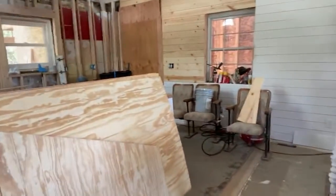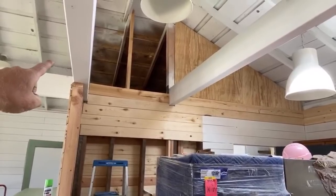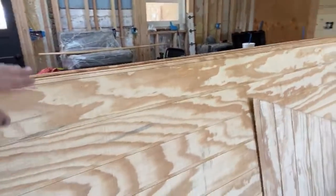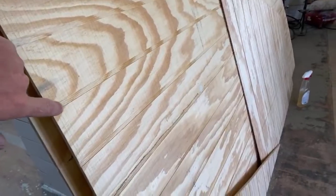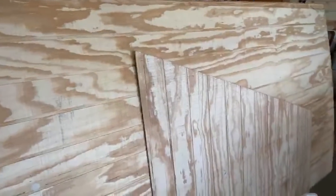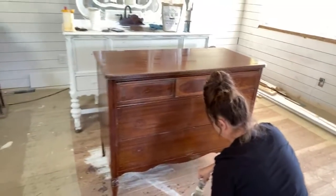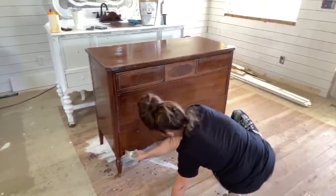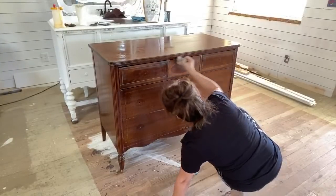While she's finishing with the primer, we've started covering the openings above the pantry and bathroom over there. That is like a faux beadboard - it comes in plywood and it's got these grooves routered in that look just like beadboard paneling, but this is actual plywood. Usually you get this in an MDF-type product. I like it in plywood because when you paint it, it looks like real wood beadboard. They have it at Lowe's. We put some up here and we're going to use it on the mudroom ceiling. The only thing is you do have to prime it all because it will bleed through. MDF is a little faster but it doesn't look as authentic.